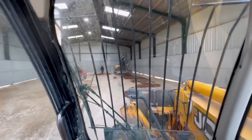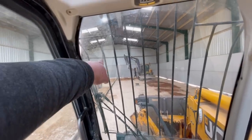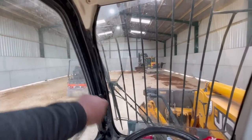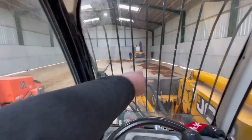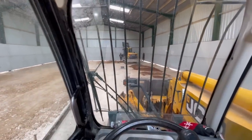What we'd do, if we're doing the whole concrete floor in one pour, we'd chain the power floats to the back of that wood there and leave them hanging, so that when we're pouring and we get to the middle here, two blokes would walk around and start power floating as we carried on pouring. But this time we can put the power floats down here and just do this side here, and then just do that side there.